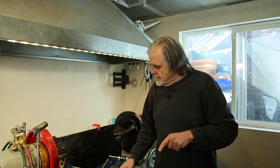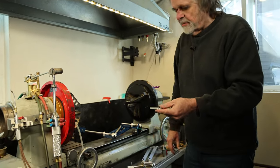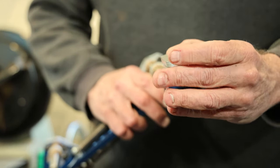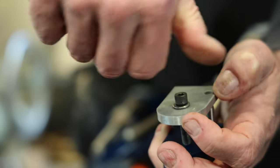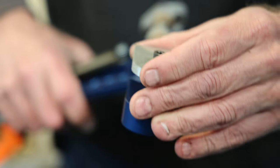The design here has been done with a retaining plate and a pin so that the screw is squeezing on the retaining plate, meaning there's no force acting to unscrew the screw when the torch is moved up and down.